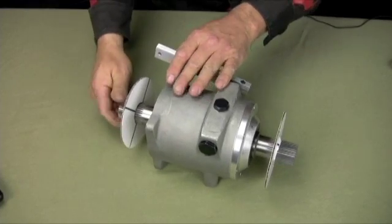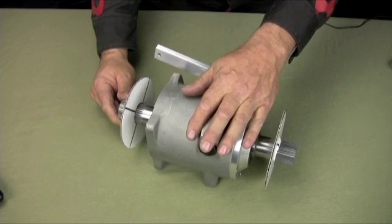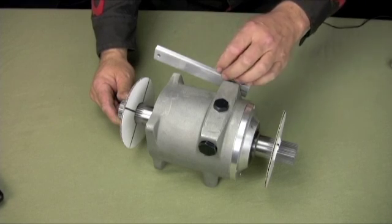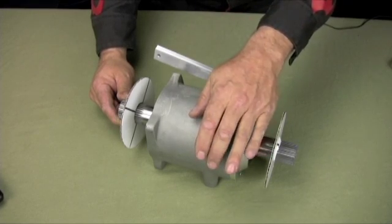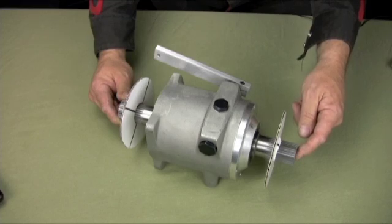And there's forward again. The shaft can be changed to either side if you need it on the other side for some reason, or point it up or point it down. The shaft does come off and does flip around and change to the other side if you need to. Each end has got a half-inch fine-thread bolt hole tapped in each end.